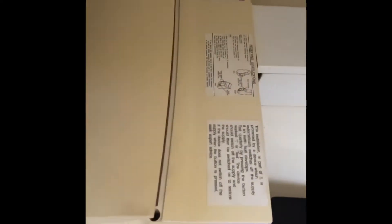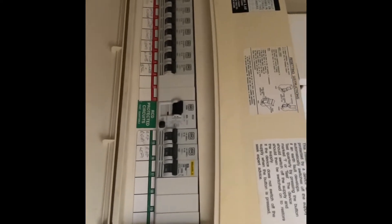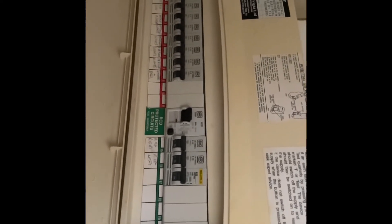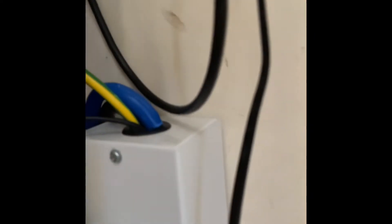This is the little consumer unit I've installed — I got it for £55. You can also buy it fully installed for £150. That's my old plastic fuse box over there, which is not compliant for this type of power, because the electric car charger draws a lot of power from your home. So this little consumer unit is wired directly into my meter and then it goes back into my fuse box.